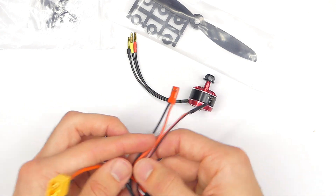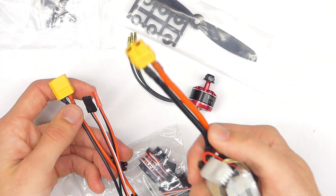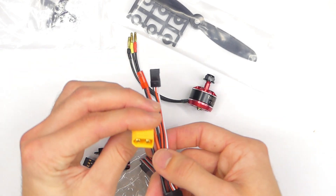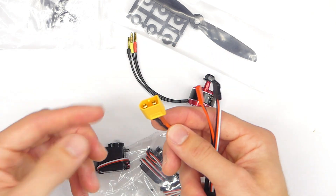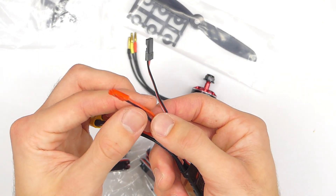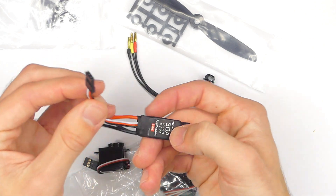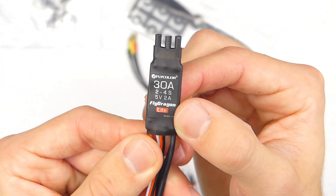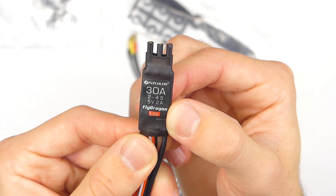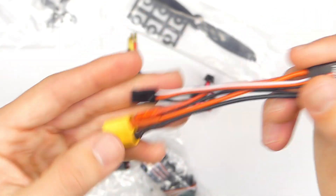The biggest thing is it's very hard to find a power combo like this that has an XT60 or XT30 connector. This one's an XT60, which is really common for FPV drone type batteries — I think it's just the most common now, either XT60 or XT30. So you don't have to get an adapter. On the ESC, it also has this little power cable — probably five volts or something to power FPV gear, which is awesome. This connects to your servo, and it's a 30 amp Fly Color, two to four cell, five volt two amp BEC — Fly Dragon Light. That looks really good.